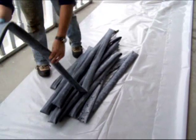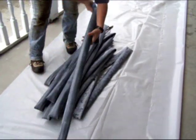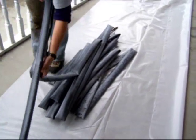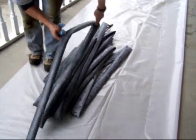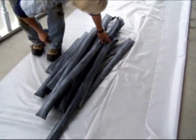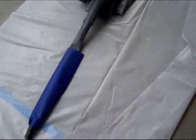Lay the liner out straight, then pull the rubber bladder out of the liner. Start with the air end first, laying it down, and then folding back and forth on top of it until you reach the pull end. The rubber must be kept out of the sun and in a place where it will not be stepped on.